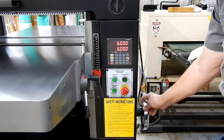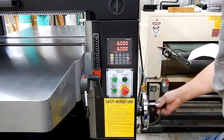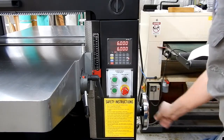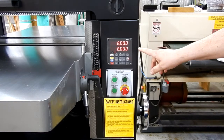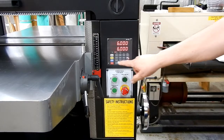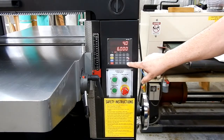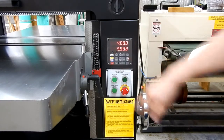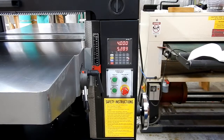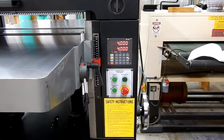Sometimes the manual wheel over here turns when this thing is automatically going up and down. Make sure you've got the hand lever folded in — if that thing were to hit you in the knee, that would sure hurt. Just to do it one more time: say we want to go back up to four inches. Program, 4.0, Enter (the backwards arrow key), and then Start.